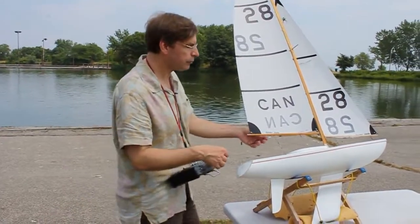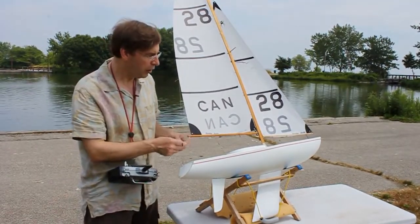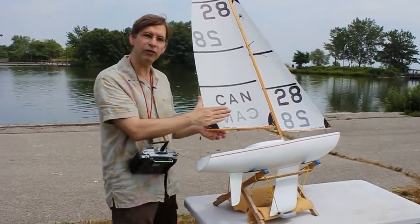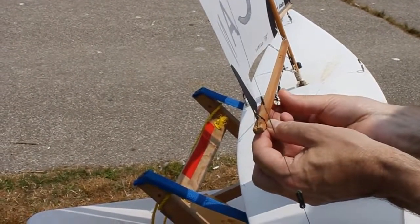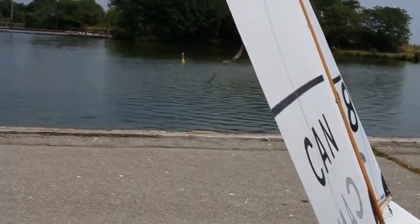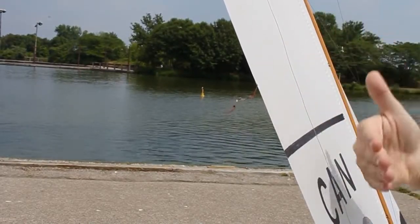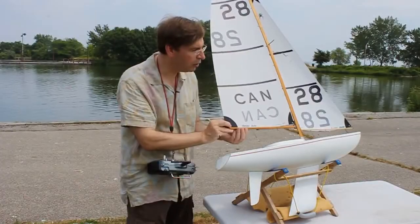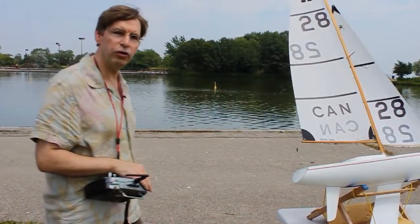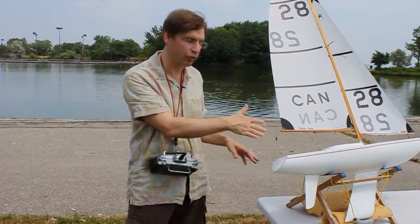So how do you do that? You tighten the jib sheet so that it pulls the club up as much as it will go, and you tighten the outhaul which reduces the pocket and flattens out the angle. I'm going to pull on the outhaul to show you the effect on the angle of the leech of the mainsail. You can see as I tighten the outhaul, the back of the sail comes flat and becomes in the same plane as the center plane of the boat. You judge it by standing back behind your boat and looking to see whether you've successfully got the leech lined up — it has to be parallel to the centerline of the boat.